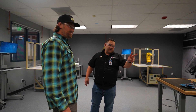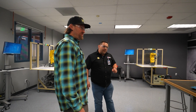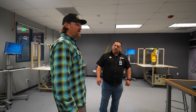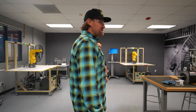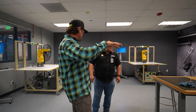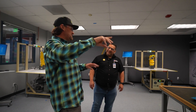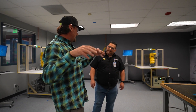The two PLCs — Programmable Logic Controllers — that we use are either Allen Bradleys or Siemens. The students are also using those to program the automation. So they're troubleshooting, learning how to program, setting the automation systems up, as well as troubleshooting them.